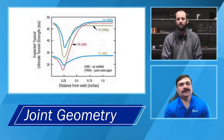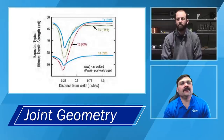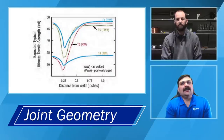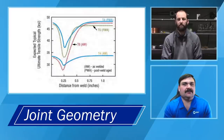Discs made specifically for aluminum. Typically, those are going to probably be a little bit better option, depending on whether they're an abrasive wheel or a diamond wheel, more of a metal wheel. A lot of times you'll see those more and more now than what we have in the past. Those diamond wheels are going to be something that's much better than the typical standard abrasive wheel. Is that what you've seen as well, Andrew?